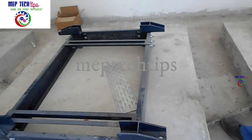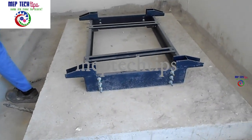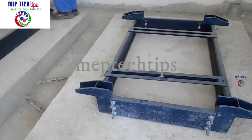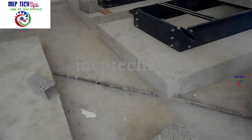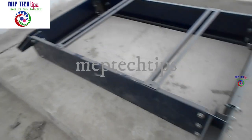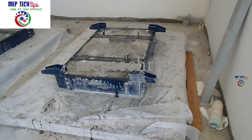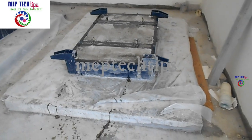After delivering the material, we placed it on the pump foundation and concrete has been filled. Before the concrete was filled, the steel structure was done by the civil team, as that is within the civil scope. Then we adjusted the mounting bolts of the pump as per the actual pump dimensions, so that exact mounting can be achieved. You can see in the video that the mounting bolts can be adjusted as per the pump.